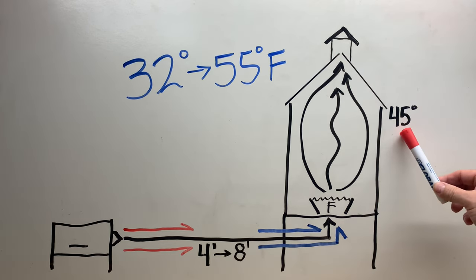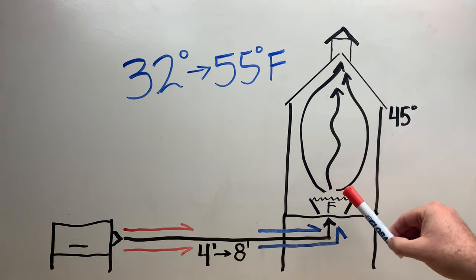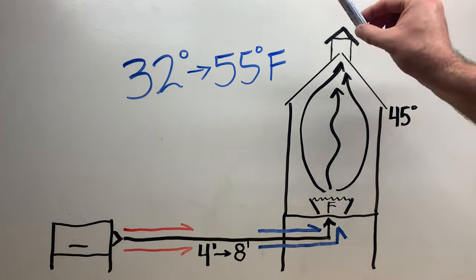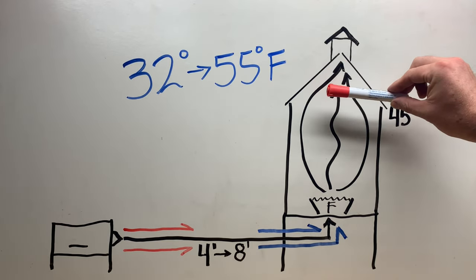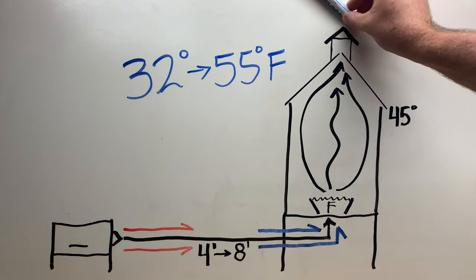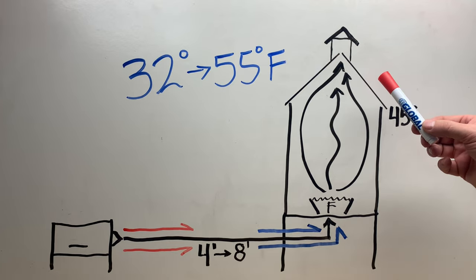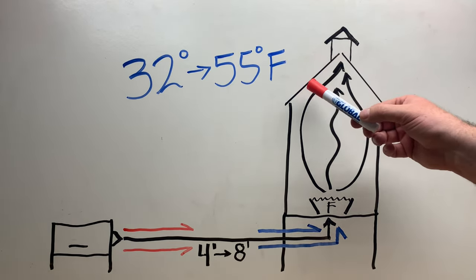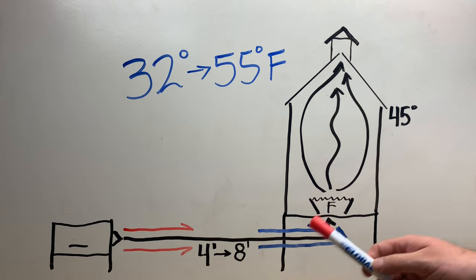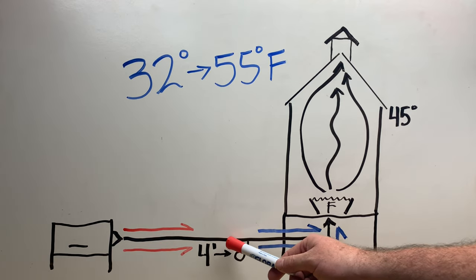There are also true design guidelines for building a chimney and firebox. The minimum roof angle you can use for the firebox is 45 degrees — you could do more, like 60, to achieve a higher pitch. What that does is allow smoke to gradually accumulate at the top and push it out. I've seen some guys do flat roofs pitched at an angle from the side so the smoke travels up and comes out that way. That works just as well — I just find this more aesthetically pleasing.